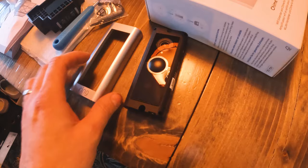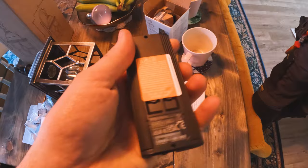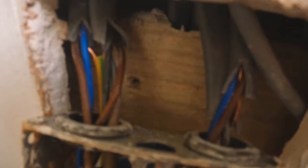That separates from that then, and you've got two fixing holes there and there. So I'm going to hold it up and see where we can put this. Obviously that is where the terminals go, so the hole going through to the inside needs to land in this section here. Mark out for that. All marked out then - we've got the top fixing hole, bottom fixing hole, and that's where we're going to drill through for the center. So we're going to send that drill bit through, aim for the middle wall. We'll have to measure up and make sure we land it perfect in between this cavity, and it should pop out in this switch hole.